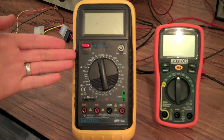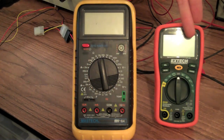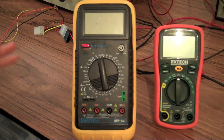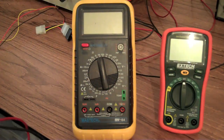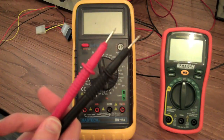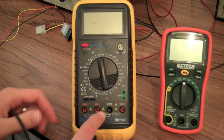This right here is the non-auto-ranging multimeter. As you can see, there are a whole lot of options on the dial. Over here is the auto-ranging multimeter — not a lot of options because it handles the ranging on its own. Let's start by taking a voltage reading with the non-auto-ranging unit. All multimeters should include a set of test probes — one will be black, one will be red. For pretty much all readings, the black probe connects to the port labeled COM, or common, or ground, depending on the manufacturer.